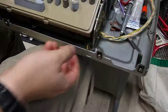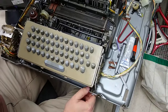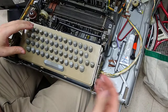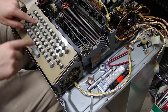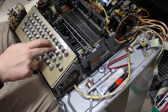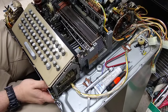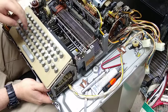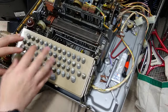If I press a key and then start the process of distributing it, the design is set up so that you can't press another key and change the code before it's done sending. The key I pressed is still pressable, but all the others are locked out. You can actually feel when it's sent — it moves a little bit but doesn't get to its full position until it disengages. It's a very positive feeling when it gets all the way down. It's a great little bit of tactility so that typists could actually type at the maximum rate of the machine just by feeling.